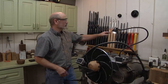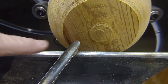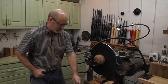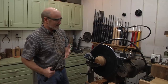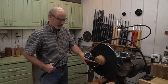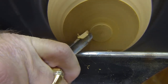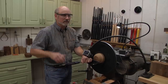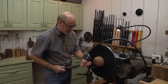You don't want to spin this thing very quickly. I'm going to grab a swept-back spindle gouge to do this. I've got it probably at about 300 RPM, and believe me, that feels plenty fast because of the feet-per-second thing — out here it's just hauling, but down here at the center it's not doing so much, so I'll just take a slow cut when I get there. I just want to get rid of the nub and make a nice big convex. I want when it's sitting flat, the bottom to dome inside so it sits on the outer edges.